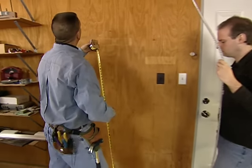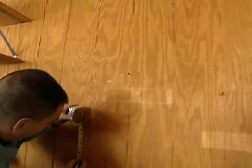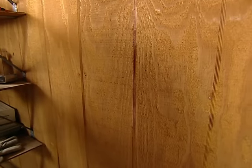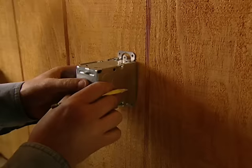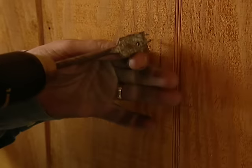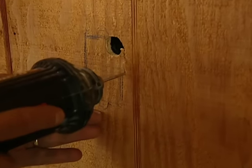We got 48 to the top. We come over here where you want it — we know we're between the framing structure. Let's mark our 48 inches. We're going to take that old work box, put it to the wall, and use it as the template for the hole. We're going to take a drill and drill out the corners of this box, then use the rotary saw to cut out the rest.